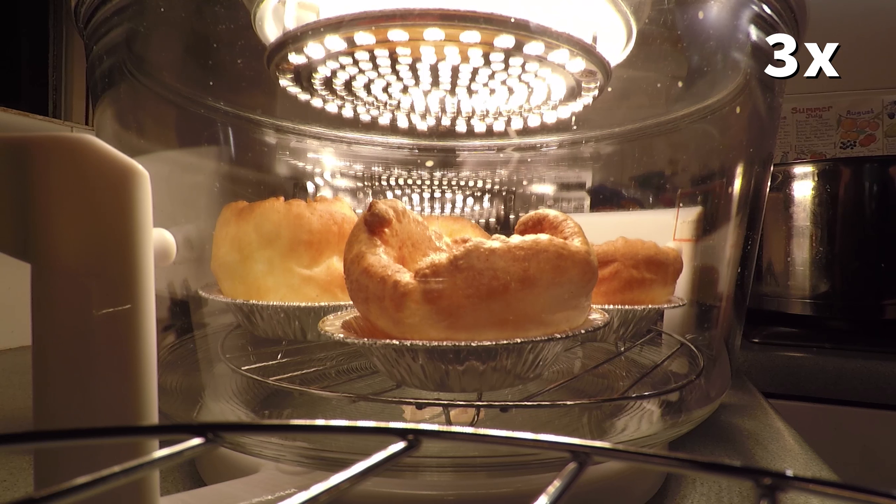At this point, if I'd been a bit more careful about orientation, I think the Yorkshires could have come out. However, I left them in a little longer so I'd get a good brown on the mistake Yorkshire. We're just looking at how well a commercial product can cook Yorkshire puddings. However, for this to work as a Yorkshire pudding machine, we're going to need quite a lot of extra mechanics involved. We'll have to fill the tray with oil, preheat the oil, fill the tray with batter, and cook the batter. To do that, we need to be able to get the Yorkshire pudding tray out of the oven and under some nozzles — we can't have the nozzles inside the oven at 200-odd degrees, they would just melt. So in the next episode I'll go over some designs I came up with and have since rejected, and the design I've chosen for how I build the final machine.